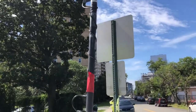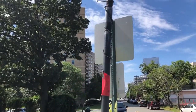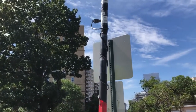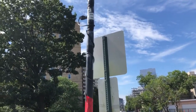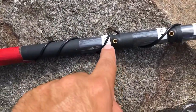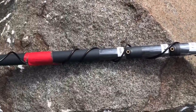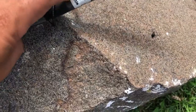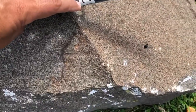I looped the bridge cable around the pole — I saw other videos showing this and it makes a lot of sense. You don't want it just hanging loose like a wire; having it rotate around the pole does a great deal for resonance and omni-directionality. Here's the 1699 antenna with the improvements: every hole tells me where to place the short with the banana cable, and on the side it gives me the length the whip should be. Currently the whip is set for 40 meters.